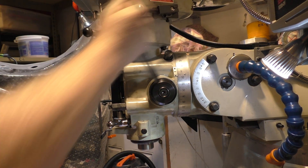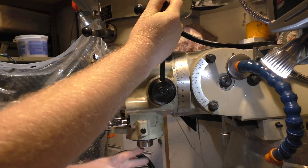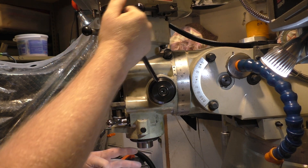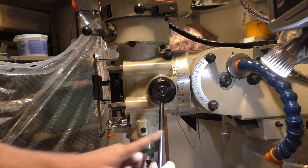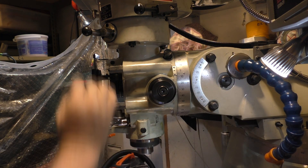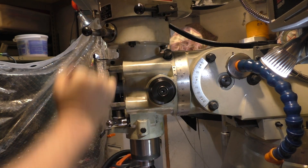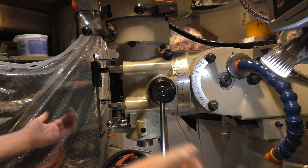Over at the mill, we've got a regular quill handle. We've all been here before — you've got some sort of drill bit, say a center drill, with the handle set just right for maximum torque advantage when pulling down to drill the hole. Then you swap drill bits, and now before the bit makes contact you've got the handle way down, meaning if you're going to drill you're pushing up, which is really uncomfortable. Instead, you pop this out, rotate it down 180 degrees, move the handle down until the drill bit is about to make contact, and now you're at the top of the swing again and can make your hole.